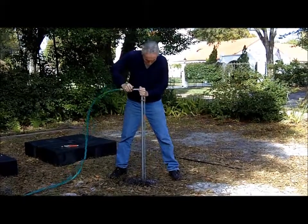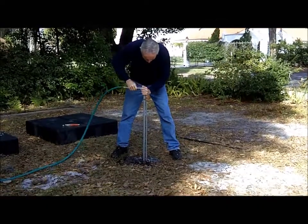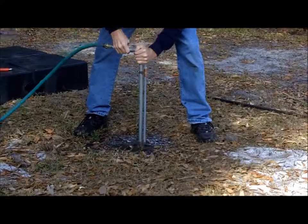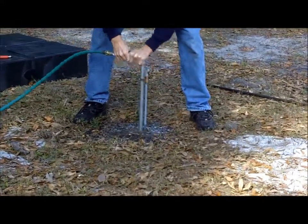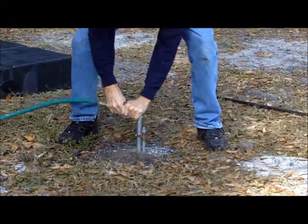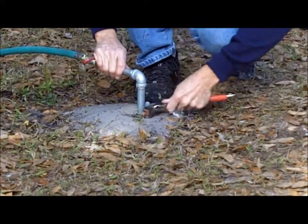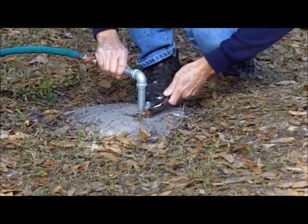In loose soil, it takes 20 to 30 seconds to run the anchor all the way in. When complete, an inch or so of the threaded rod should be remaining above the ground. The retaining nut is backed off and the water jet tool is removed from the anchor.